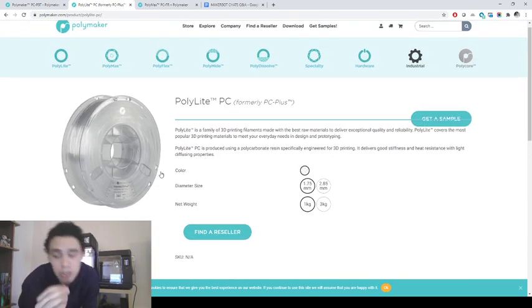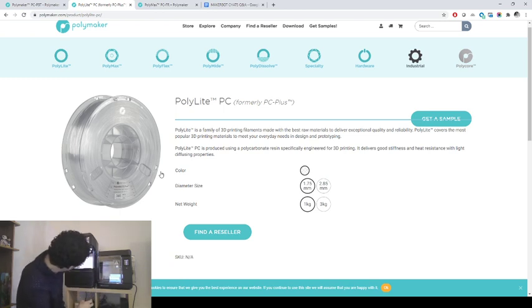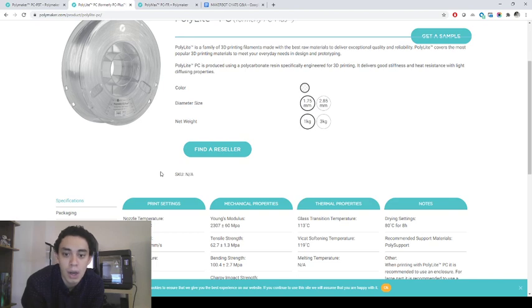I mean, depending on the application, depending on the shape itself, you can make it be very translucent. If not entirely clear, it will allow light to go through, right? So you can see it here. If I put this against the light, let's see if it works here. No, I need to put the light inside of the shade, but it definitely allows light through. Depending on the number of shells that you're using, depending on the geometry itself, you will see different results. So something to consider if you're trying to create something translucent, like a lampshade, something that requires for it not to be opaque.